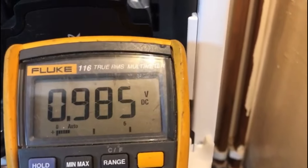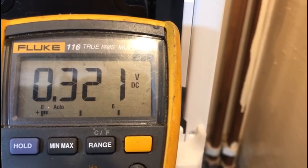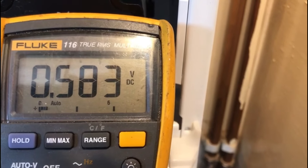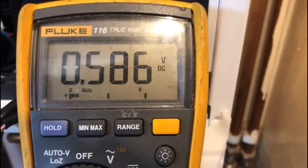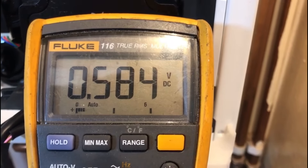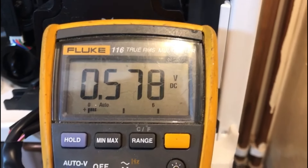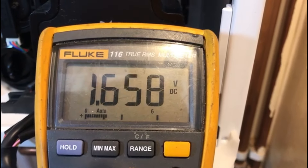To confirm: between black and pink you should see 2.5 volts DC, and between black and yellow, depending on fan speed, you'll have between 0.5 and 1.8 volts. You can turn the fan off by lowering the potentiometer and then increase it again, letting the thermistor temperature drop — the fan fires back up, demonstrating the voltage change live.